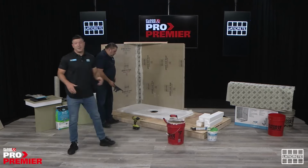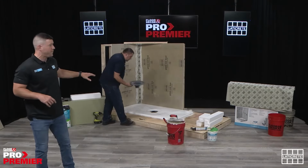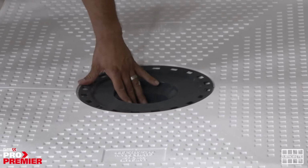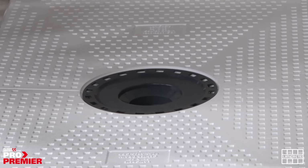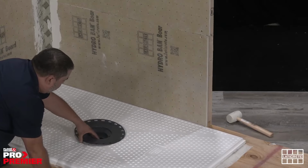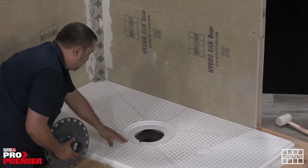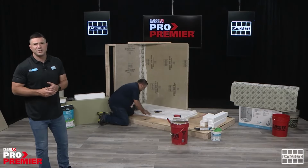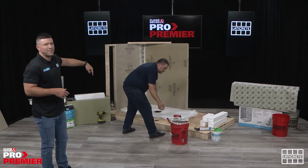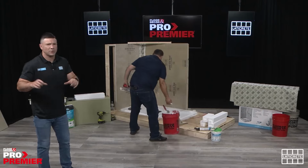Like we did with the pan, we recommend that we dry fit the bonding flange drain into the cutout of the pan to make sure that you are in the location that it needs to be for connection to the waste outlet. As you can see, we have a good fit, and we're gonna get started on taking that bonding flange and adhering it directly to the bottom of the pan. So much like we do when we apply the sheet membrane to the pan, Adrian's gonna spread the thinset all around the bottom rim and then press in that bonding flange. And as he does it, I'll talk through some of the intricacies.